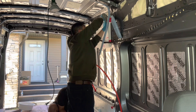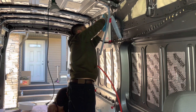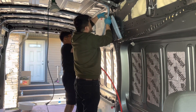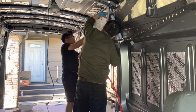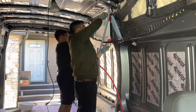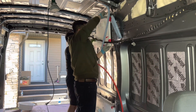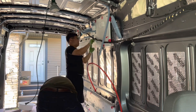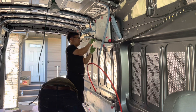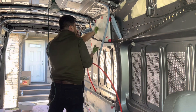After all this preparation, we can install each individual wall panel onto the wall. I'm using 1.5-inch long stainless steel bolts secured onto those rivet nuts. During installation, at the very first couple of turns, I have to be very careful to prevent cross-threading, because the rivet nut will be very difficult to repair.